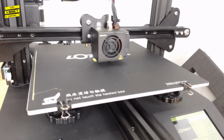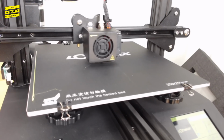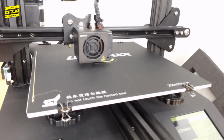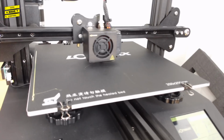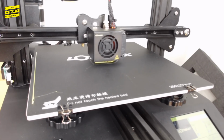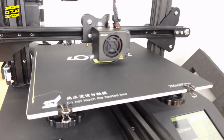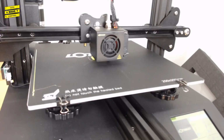I guess one of the things is it basically takes some of the weight off of the print head and really lowers the inertia of the print head, so that allows you to print extremely quickly. And I think that's probably one of the reasons why these printers have gone into this Bowden style setup, where the extrusion motor is actually not located on the print nozzle. So I see why they do it, but I do agree that direct drive printers definitely have their advantages. Especially if you try to print more exotic filaments, like I know NinjaFlex, for example, almost requires a direct drive extruder, or at the very least, a very, very short Bowden tube.